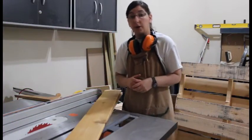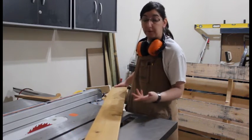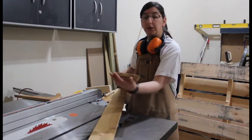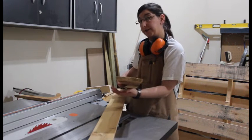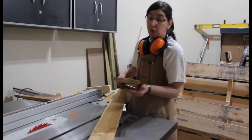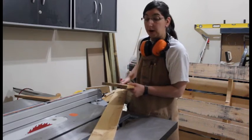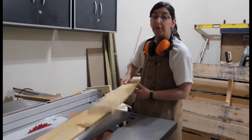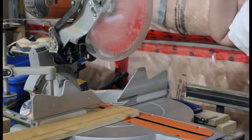To make your LED shadow box we're going to start with the backs first. I'm just using leftover cedar boards — fence boards — about five-eighths thick, and both edges are round-overs. We want to get rid of one edge so we can start with a square piece. I already did that on the table saw, and then we want to rip it down to four inches in width. Then we clean up one of the edges so that end is nice and square.